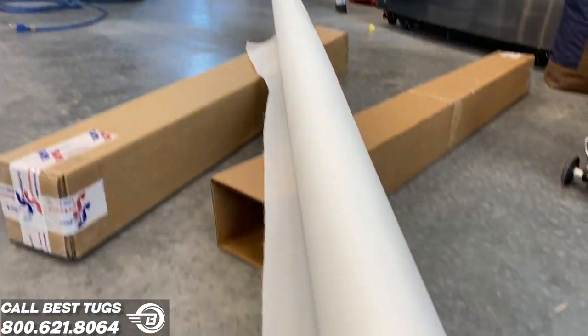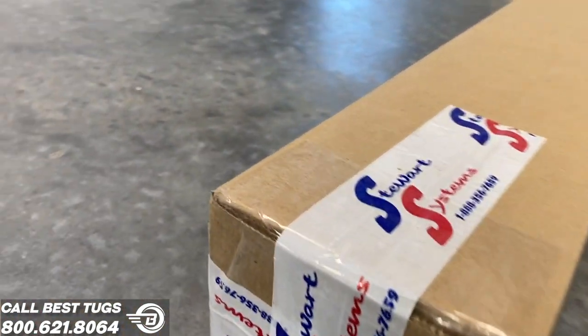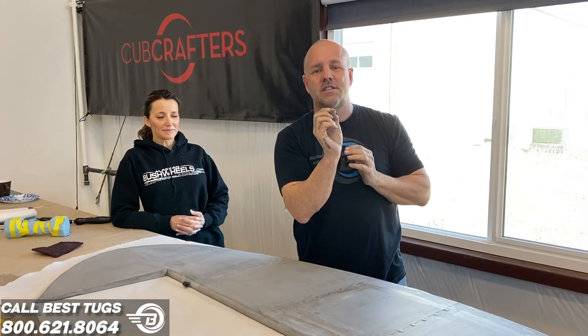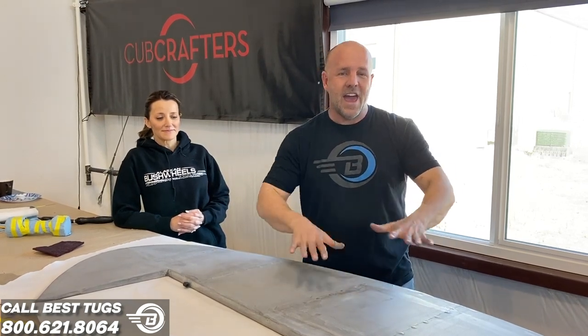But more importantly, when you do two layers, we lose that tape seam, but also it's like making a sheet of plywood. Two layers of fabric put together is stronger than a single layer of the same thickness. Getting that bond between the two is like layering sheets of material. So 1 + 1 = 3, not 2, when you do this method. And we lose the seam.